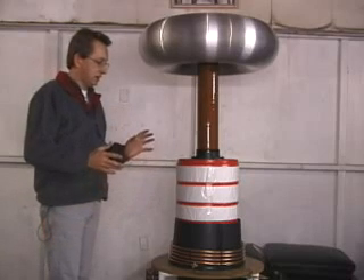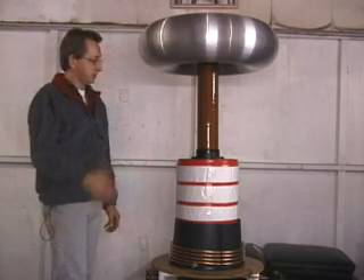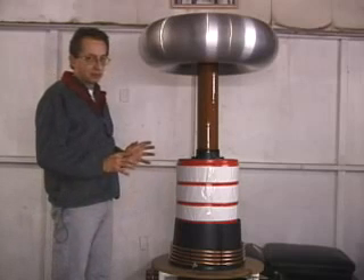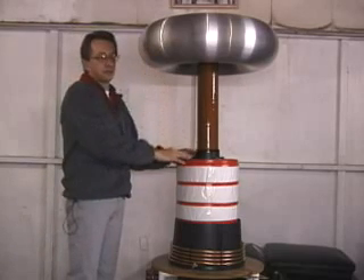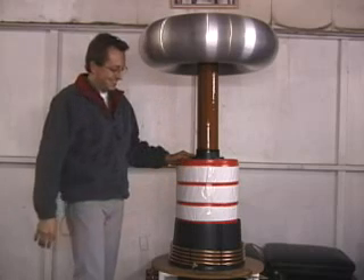Really, the only thing I had to build extra was the primary coil from components I already had. Basically, what I have here is a three-coil system — it's a magnifier, a 3LC system. What's different about this coil is the extra coil and the top loader right over the top of the driver, which is a little different than something normal.